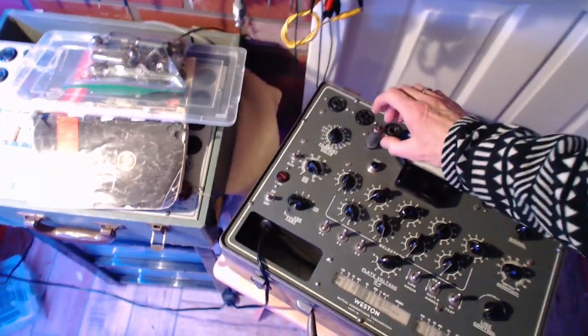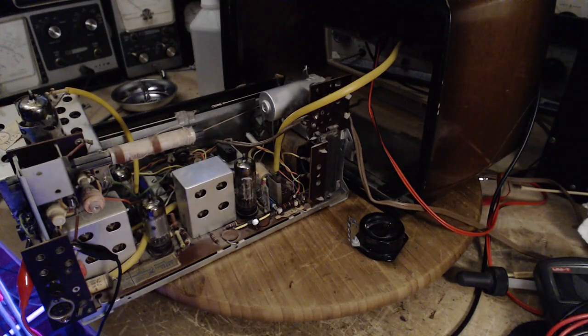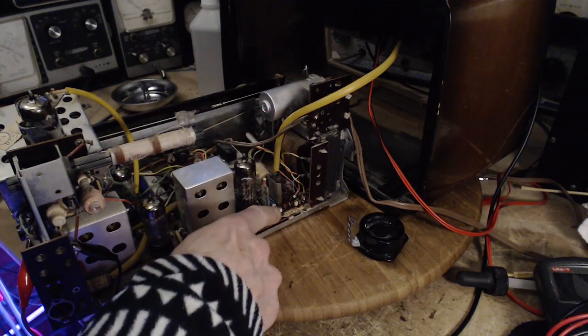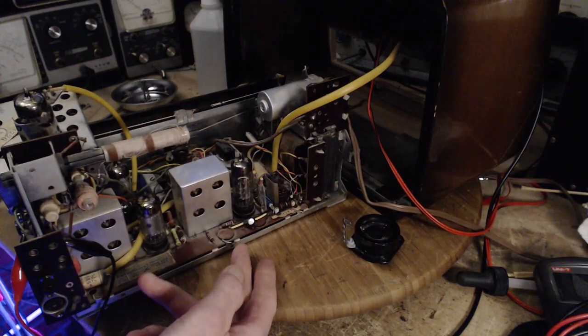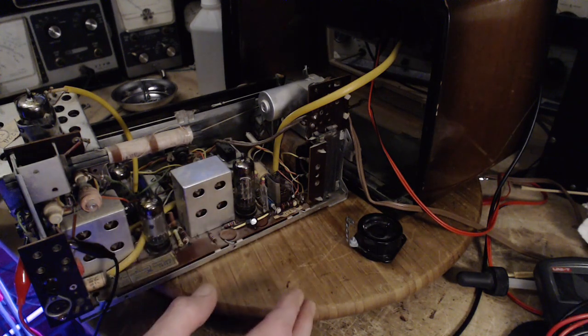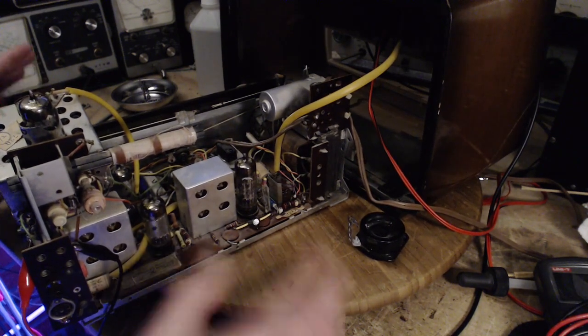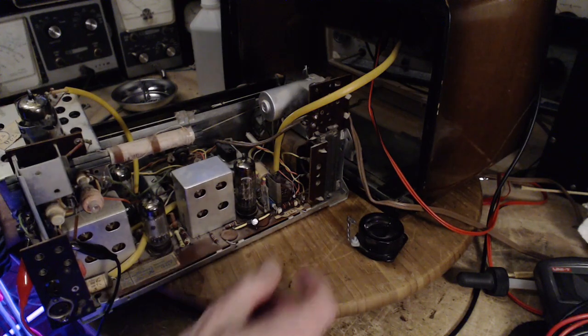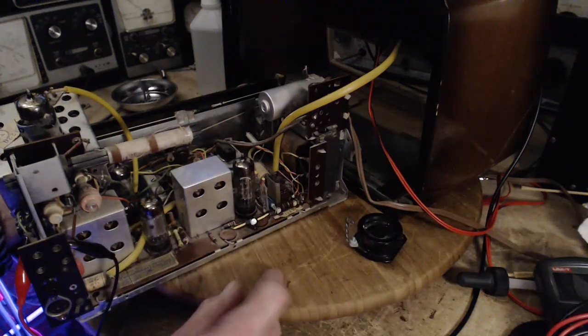So in the radio, operating this tube, oh wow, it's gotten hot already. Operating that tube in the radio safely, I think involves a couple things. One is having the tube in the circuit and measuring the cathode resistor voltage drop and determining what the bias is on the tube. That's number one. I think that's number one. You know, what I would be worried about is the old 6AQ5 behaved differently because it has a defect in it. I mean, this is a bit of a long shot here. And putting a nice new strong 6AQ5 is going to make smoke come out of this resistor before I can test it and save it.